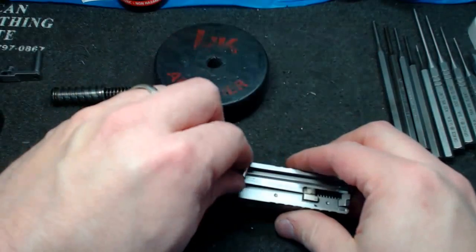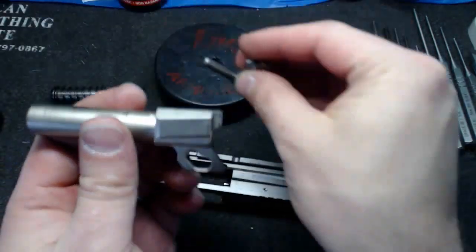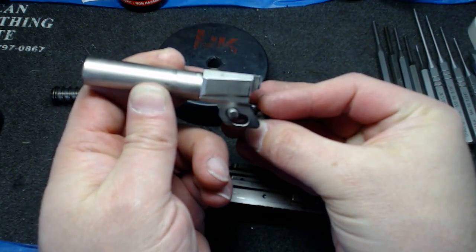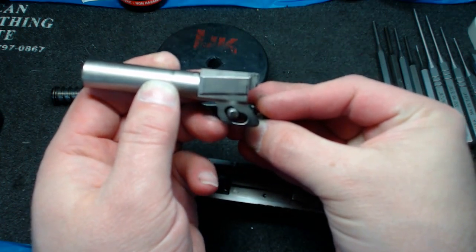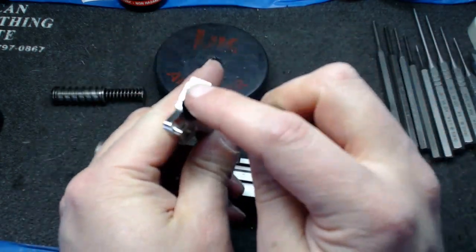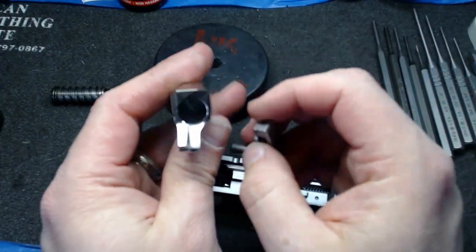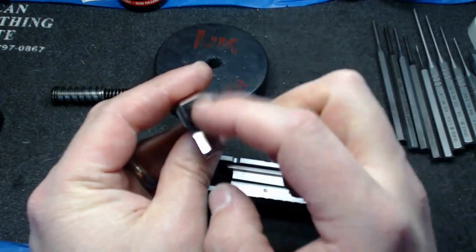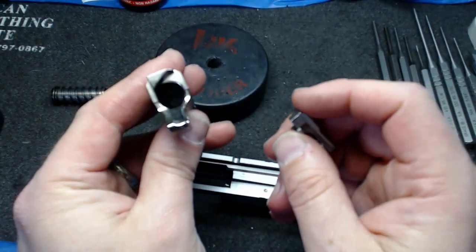All right, barrel, just wiggle it out forward. Standard issue for the most part, a tipping barrel design. When the gun recoils, this pin acts as the actual lock. So it's going to travel straight back, and then it's going to have to tip down. The same thing on the way forward. It's going to raise up and then lock itself into position. It does have a fairly unusually large hood, and it's also cut away a lot. I assume that's just because of the design of their angle of ejection. The other thing that's a little odd is the ramp is also slightly off center.